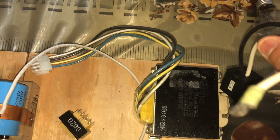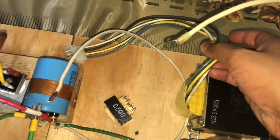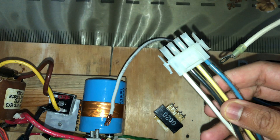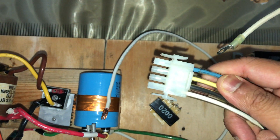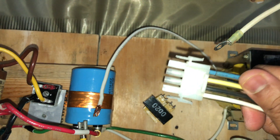This is the secondary high current low voltage output; it also has around 15.6 volts. As you can see in this particular transformer, the primary side — the high voltage side — actually has four wires. In fact, a lot of UPS transformers do have more than two wires, so it can be a bit confusing to identify which is the high voltage side.